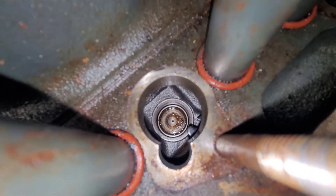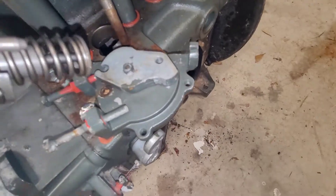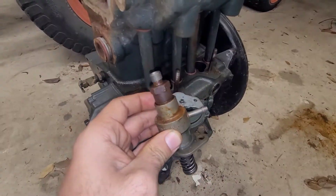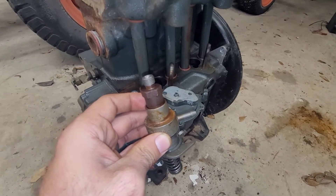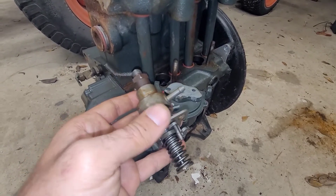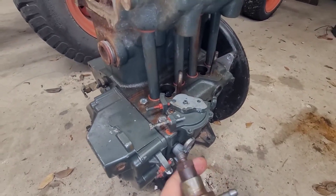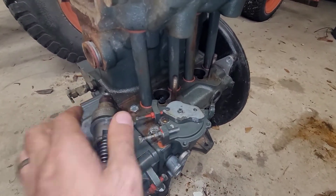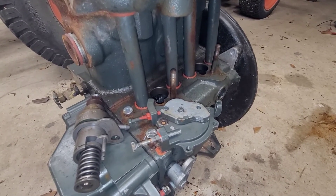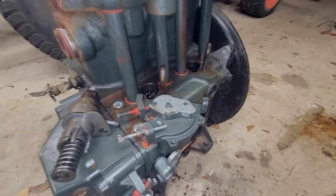The problem you might be having if you took both of them out is the rail being in the wrong position. Say you go to start the generator — it'll start, but it'll either have a really low or really high RPM, or depending on where these are it may not start at all. It's not going to run right. Or it'll scream, you'll go to shut it off, and it won't shut off until like 30 seconds afterward because you're having a runaway engine — you have no control over the fuel coming out of the pump because that's what that bar does.